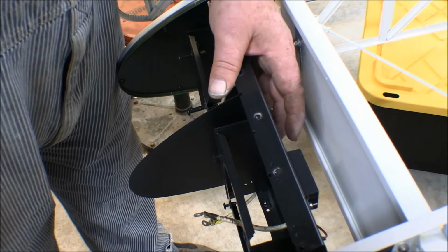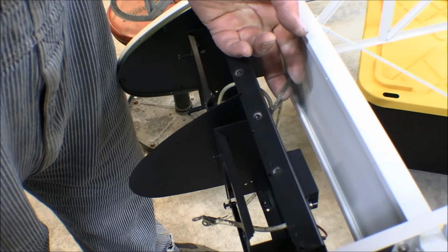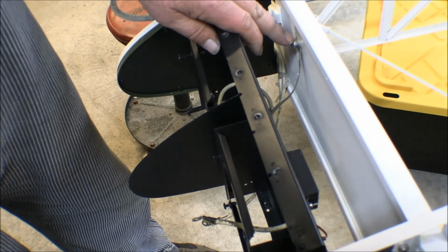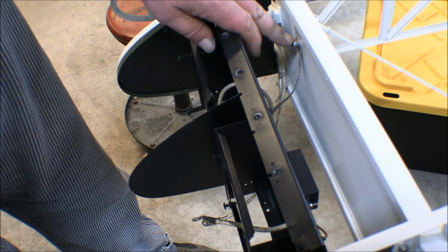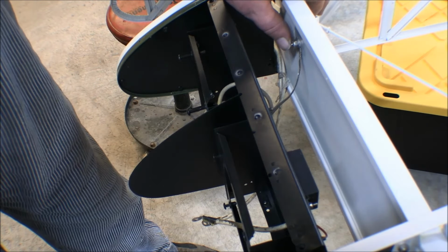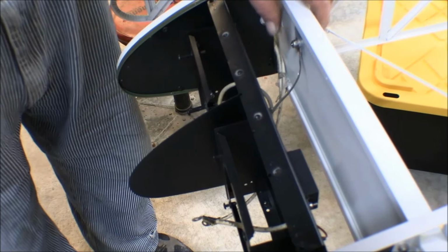Well, I just put the ground cables in for the landing lights, one for the inside and one for the outside. And then I've got a braided ground wire here that I attached to that same screw that I put into the landing light assembly. And then I went over here, there was an existing hole in this spar, and I took a little bit of paint thinner and cleaned off all of the paint and everything from around that hole. So it's nice bright metal right there. That was all cleaned up, brightened with Alumabrite. It's not going to get any cleaner than that, scrubbed down. So anyway, I put a bolt in there, and that ground wire goes to that. So that should have a good positive ground for the landing light.